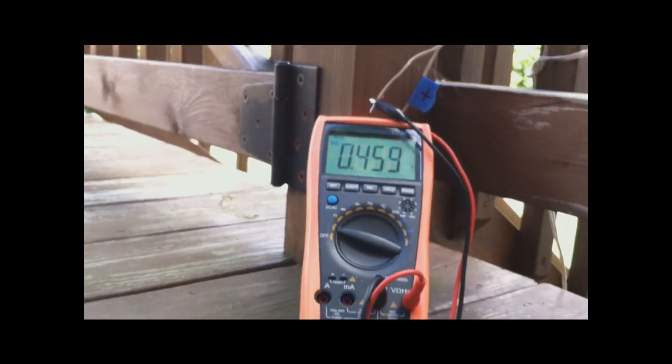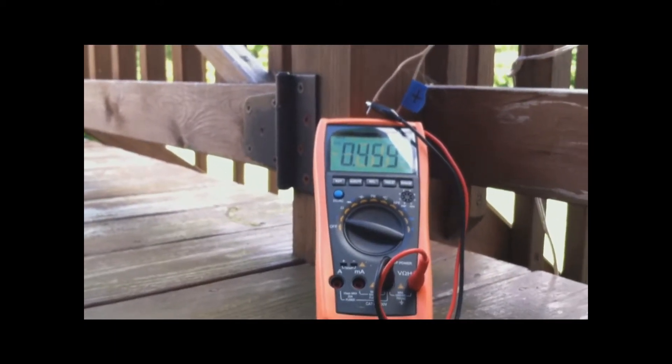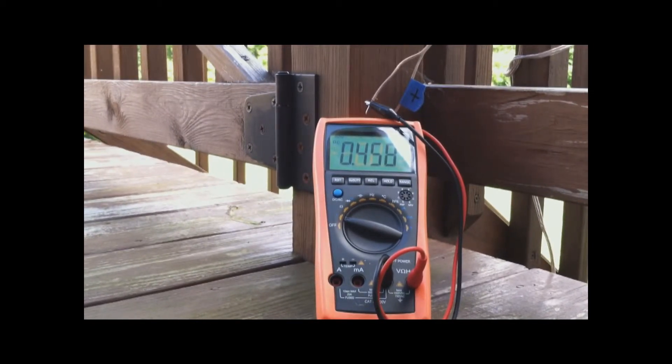I dumped a bucket of water on top of it. But before I did that, I rewired the entire battery into parallel. I left it hooked up in series overnight and it only ended up putting out about 1.3 volts. So I figured it would probably be more beneficial to have everything hooked up in parallel and have over 100mA, versus having 20 or 40mA at a volt.